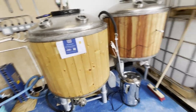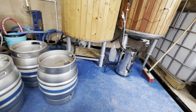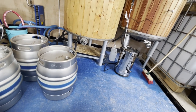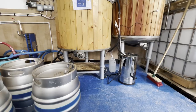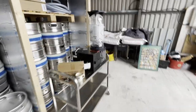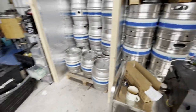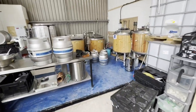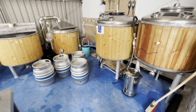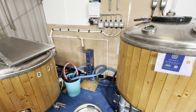The problem was, I put the cooler on that little plinth underneath, if you remember. The condensation formed on the dish bottom, which is steel. I won't show you now, but trust me, it had pooled on top of the cooler and got into the STC, which was just on the top like that, and I'm blowing the fuse, so I can't keep it under there. I don't need it now, because as you can see, we're packaging today, so I need to rethink that. I need to get a shelf up above it probably, or a little trolley or something.